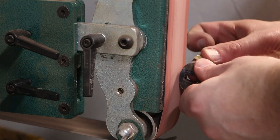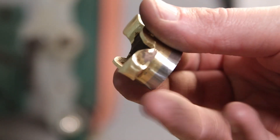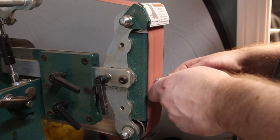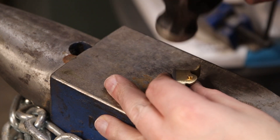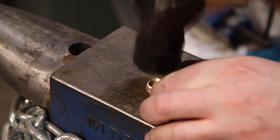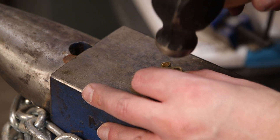It's the next day and I'm back over the belt grinder, trimming off all the excess on the sole and grinding it down until it meets the body. This sole is entirely too thick for this plane at 360 thousandths of an inch, but the reason I did that was because I wanted to add in curves on the bottom in two directions — both front to back and side to side. Now it's time to peen over the cross pin. I should have put a spacer in there because I ended up bending the cross pin during the peen, but this is a plane for personal experimentation so it is what it is.